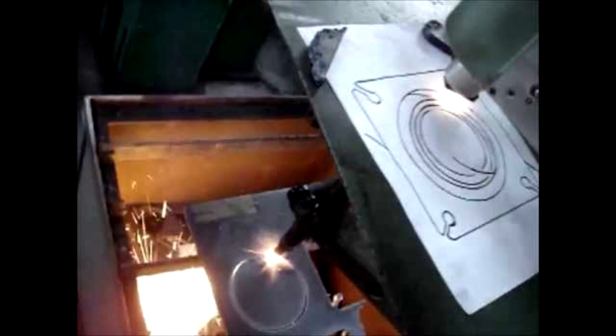This drawing was then placed on a tracing table, and the magic eye was positioned over the black line. Then, through the use of a powerful light and also a range of glass prisms, the image was reflected through the glass prisms using a sensitive transducer which converted the image into electrical signals which then controlled the machine.